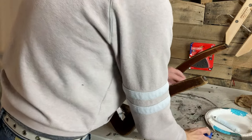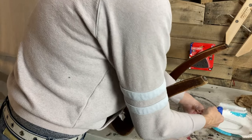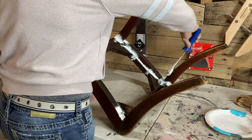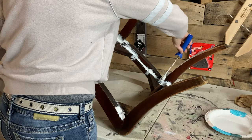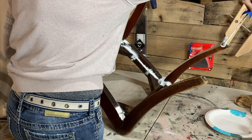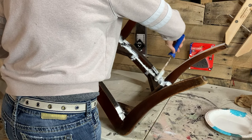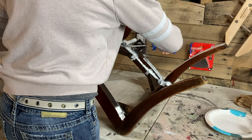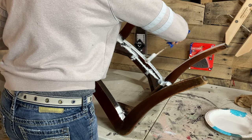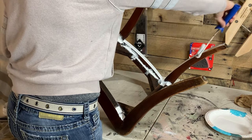then you can go in with a microfiber, real short, smooth roller, and you can put a thin layer by rolling it on, and then that resembles the texture of the sprayer. And it also gets it on there faster.